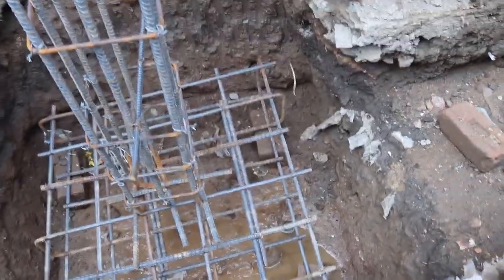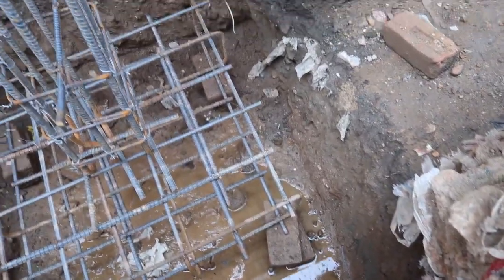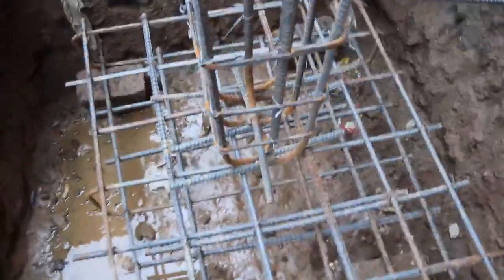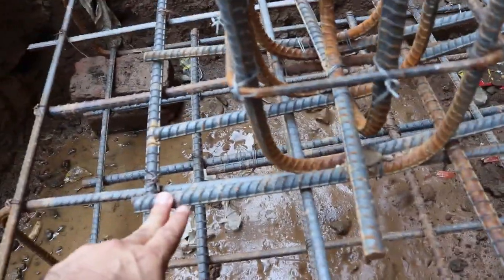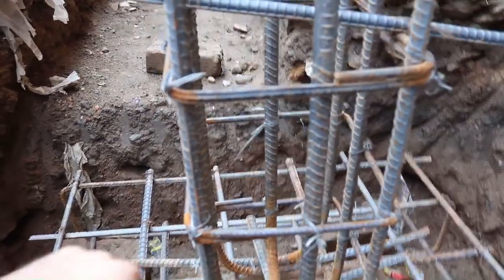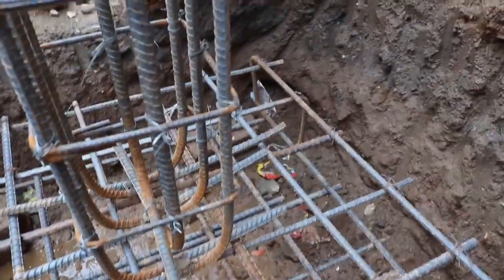As you can see, this footing has a depth of just 1.5 feet. In many videos I have already discussed that the depth of the footing should not be less than 1 meter. You can see the reinforcement details and the column legs — this is not correct. Also, the lateral tie spacing at the bottom is too large; it should be minimum at the bottom.